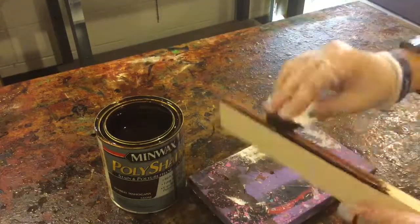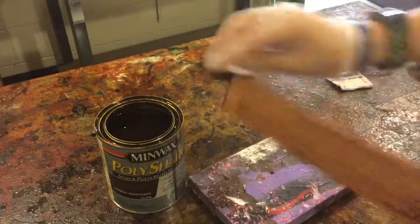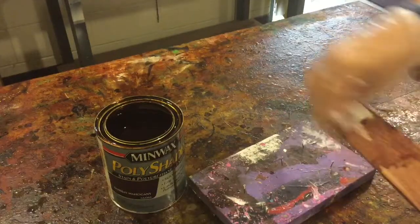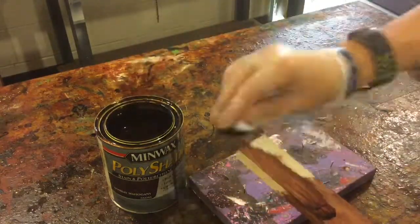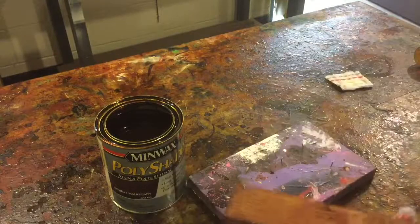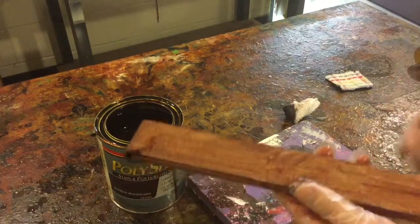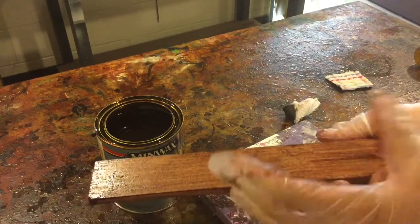Coat the entire thing with your stain. You can see how the wood grain is still visible but the stain is literally dyeing the wood and changing its color, which is pretty cool. As you need more, dip back into the can. Make sure you get all your edges and ends — you do not want to leave any of the wood unfinished or unstained. Once your board is completely coated, you'll see smear marks all over it — that's normal. Let it set for about a minute so the wood can act like a sponge and the pores and fibers can soak up the stain and clear coat.